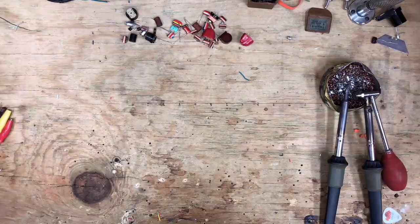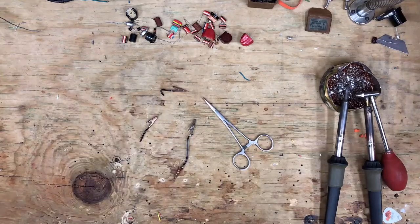And a heat sink is basically just something that goes on the lead of the component between the heat, the soldering iron, and the body of the component. The nitty-gritty. Typically what I use is alligator clips. I've got some copper alligator clips that, you know, copper really pulls in heat better. You've probably seen it in the videos when I'm working on stuff, but I have a set of forceps. Forceps are great because you can use them as a handle and they lock down, but also they're a killer heat sink because they have so much mass.